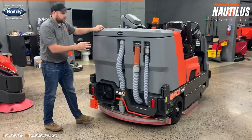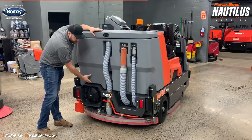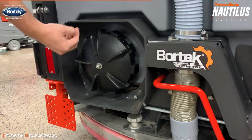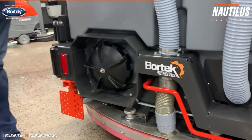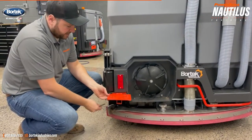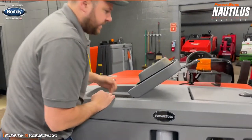What we're going to do is drain out here. If you have a lot of sediment in your tank — if you've been working in an extremely dirty environment — a lot of dirt is going to build up on the bottom of the tank. The Nautilus has an excellent feature that lets you open up this main drain here, which gives you access into the bottom of the tank. There is a seal and gasket, so make sure when you put it back on, the seal is facing the tank, otherwise it's going to leak. This is just a twist and hand tight only — if you over tighten it with tools, you can crack the seal and cause a leak. There's also a step that gives you easier access to clean out your dirty water tank — put the pin in and you can step up.